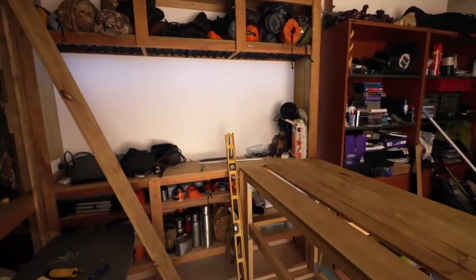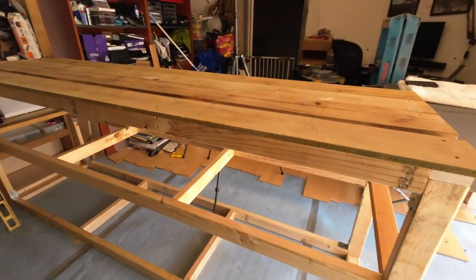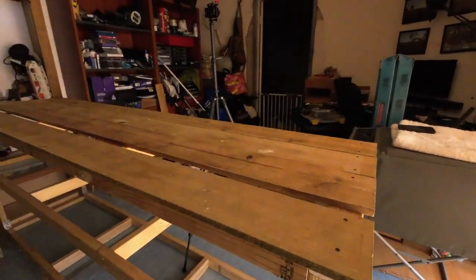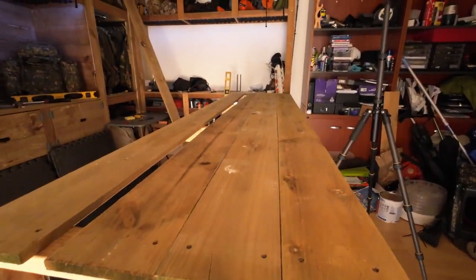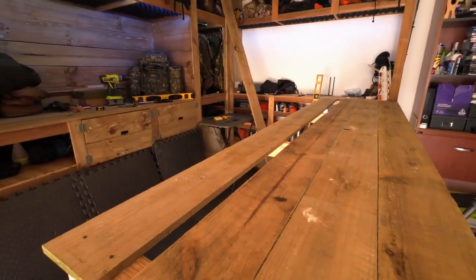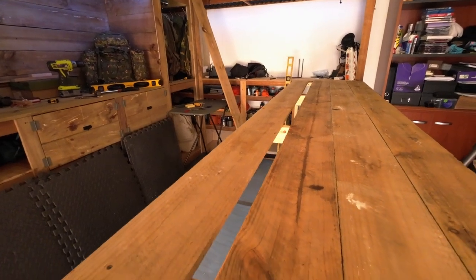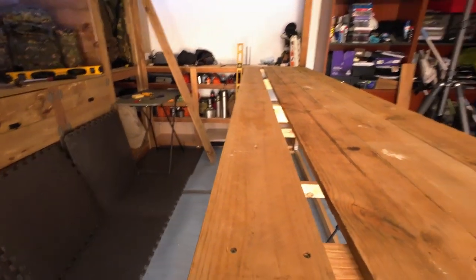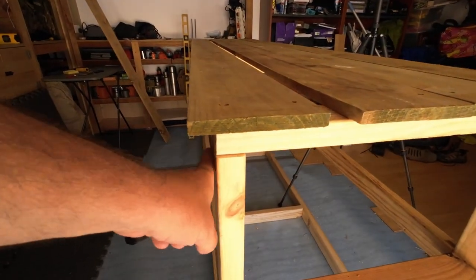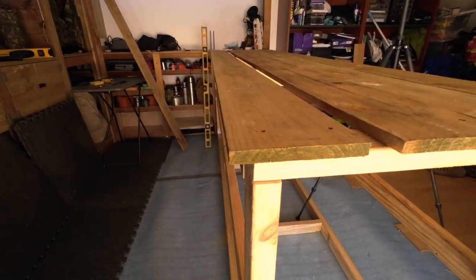And then, let me show you, this is what I started on today. 2.4 meters in length. The actual frame is 600 wide, that's millimeters. And I'm in the process of putting the top on, which is just making it a lot more stable and rigid. I've got a trimmer piece here to fit it in because I wanted to overhang this side, so when the actual doors and everything fit on here, that will still be just past by about 5 or 10 mil.